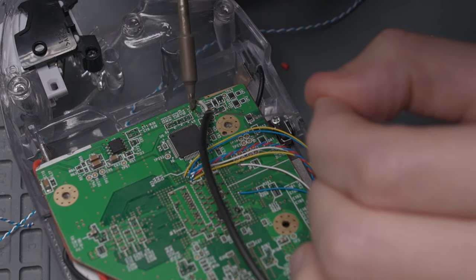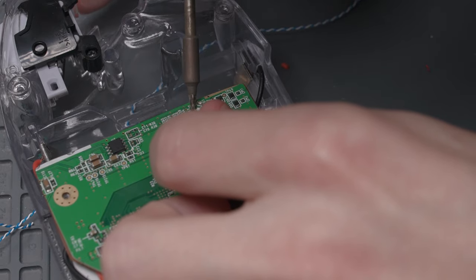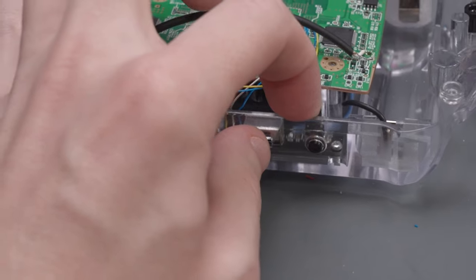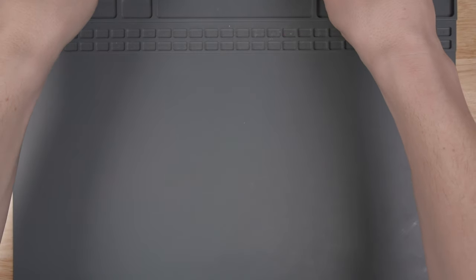At this point, I wanted to test to see if the Wii would still boot. So I re-soldered my Wii AV port as I did in my trimming video to check for composite video output. I added one battery to the Ashida and booted the console, but I didn't get any composite video output. I think this issue was caused by that MC ground wire being in the wrong spot.